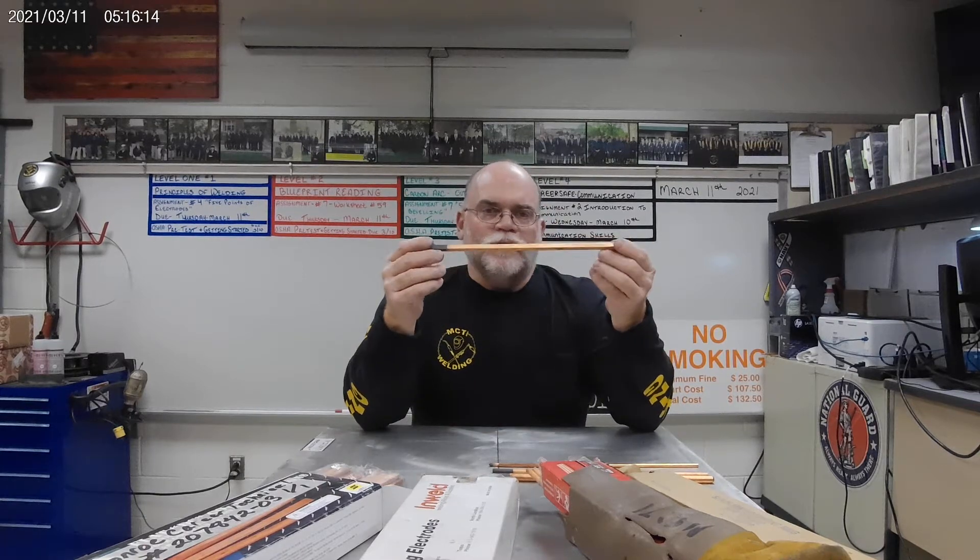This one is one of my favorites — it's called a butter knife. That's a slang term for a flat-bladed carbon arc rod. It can be held just like anything else, but it can remove an enormous amount of material. It's best for shaping: if you're going to be shaping some kind of object, this is the best way to do it. It doesn't dig down deep, but it digs broad, and for the 300 to 400 amps you're going to use, it can make a very large job go a lot quicker.